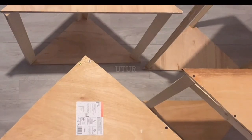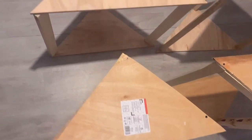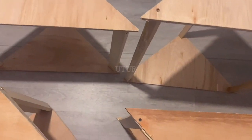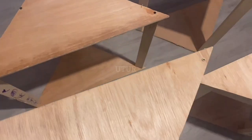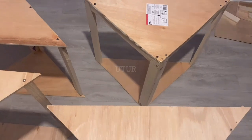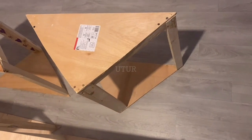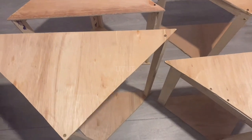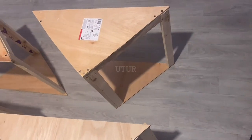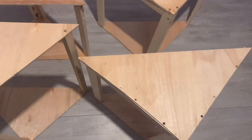To see how to overcome rework of the diagonally cut plywood bases with respect to kickbacks or binding when using the circular saw, click on the link in the description. Visually inspecting the screw heads used to tuck-tighten the hardwood plywood boards onto the housing frame — they have different colours because some screws are shorter than the 4mm-diameter 60mm-length screws used to couple pine woods together. The plywood is only about 9mm thick, so shorter screws are needed to couple it onto the pine wood structure without driving them in further than necessary.